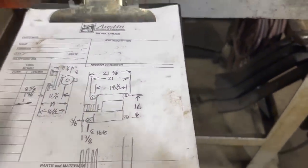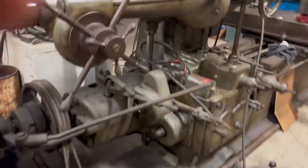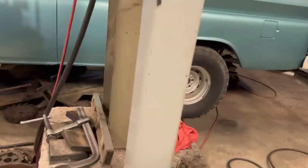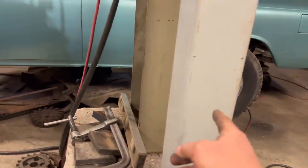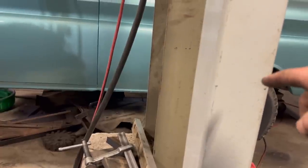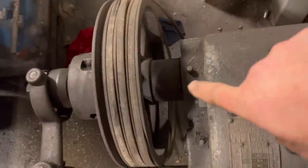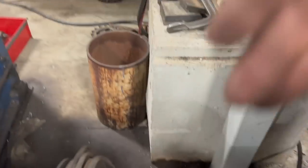I've done a ton of math on this. By the numbers, this is going to fit. The whole assembly goes on a line of crane posts. From the tabletop to the center of the motor is 11 inches right now, and from there out to the center of the oil cup — the drive pulley for the boring mill — is about 11 and 3/8 inches, so the belt is going to be nearly vertical, straight up and down. That's ideal. I can always space the motor out a little bit too. I'm thinking I'll bolt it all together, level it up, bring it over with the crane, and just see how close I am.